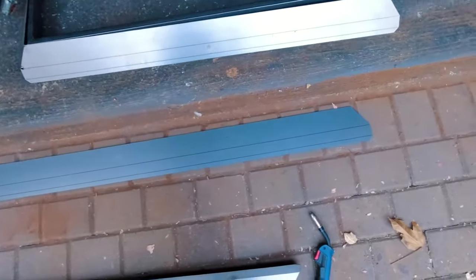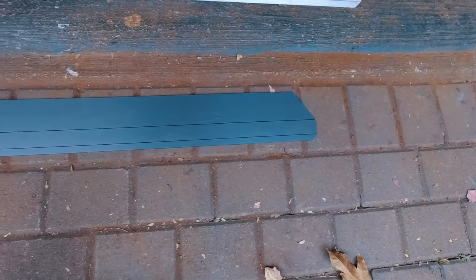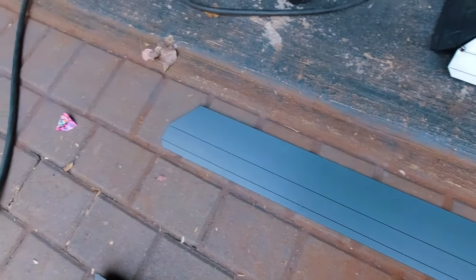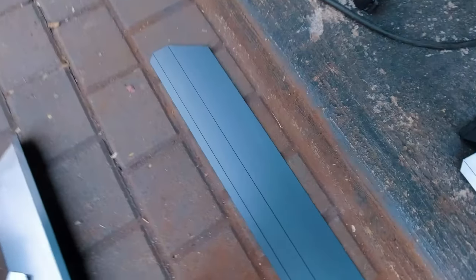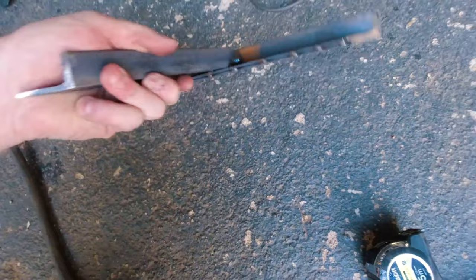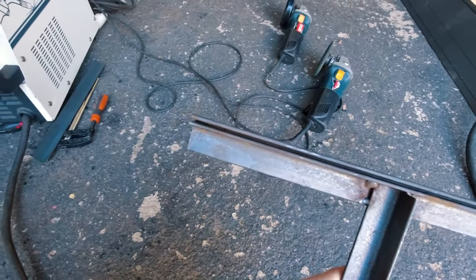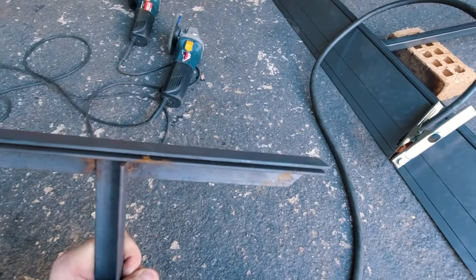I'm going to work on a piece of the roof section now. When I get the steel from the laser cutter it looks like this — all the lines are pre-cut onto it. I will be folding on those cut lines. I left little bridges in — you can see those two pieces there — that basically keeps it aligned for me so when I weld it on later it's already lined up. This gadget I built myself — it's just a bending tool: two angle irons welded together with a small slit that I can slide the steel into and then fold it over.